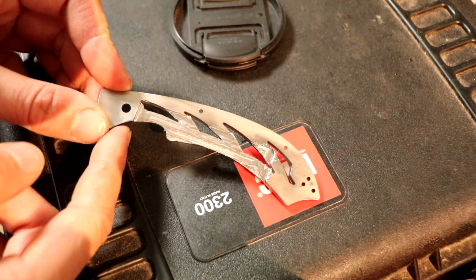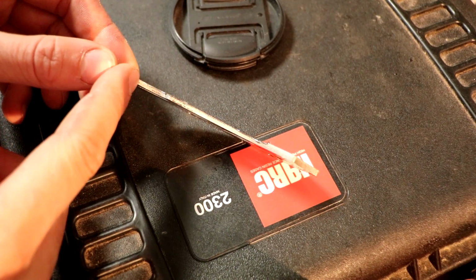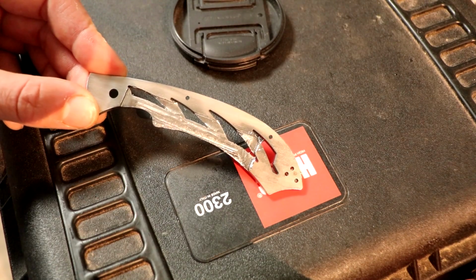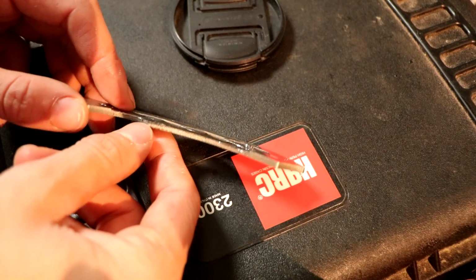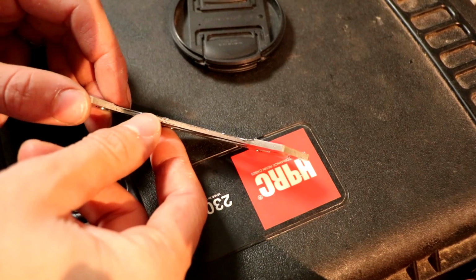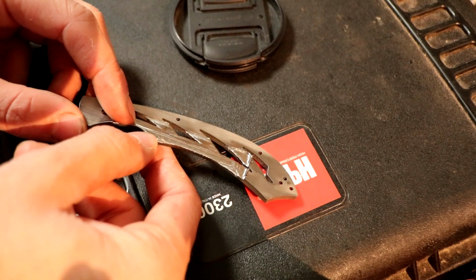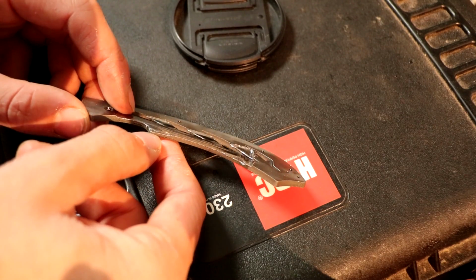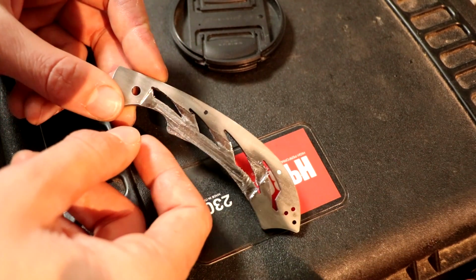Okay, so I've been milling. You can see the shiny part is where I removed material, but I'm just not happy with my progress and how it's going. It's very tough. You think you remove a lot of material and then you measure it, and in 4 passes you did only 0.5 millimeters, so half a millimeter. So it's really tough material, and I don't know what it is.